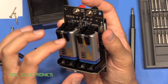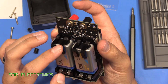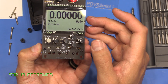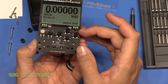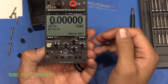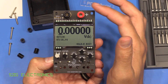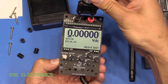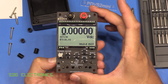We can see the Atmel microcontroller just hiding behind the battery holder, along with some of the analog electronics behind the batteries. The LCD is at the front mounted into some pin headers. The user interface consists of push buttons on the front, and there are two banana jacks which accept standard spacing so you can plug banana adapters straight into a coaxial lead to get the lowest noise possible.